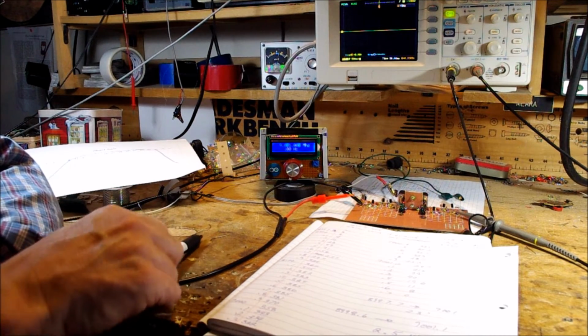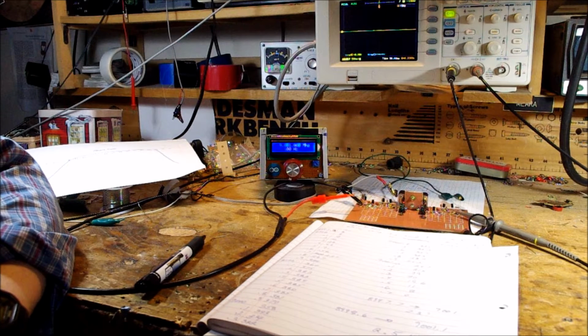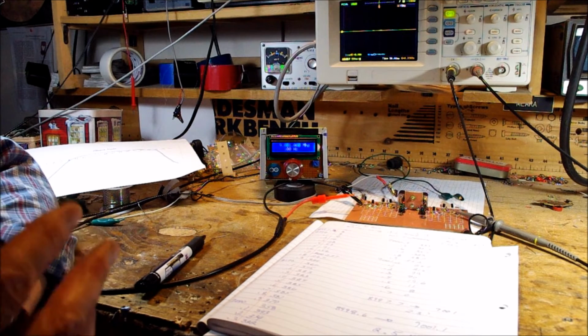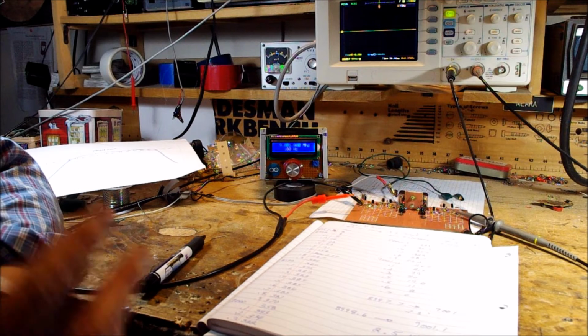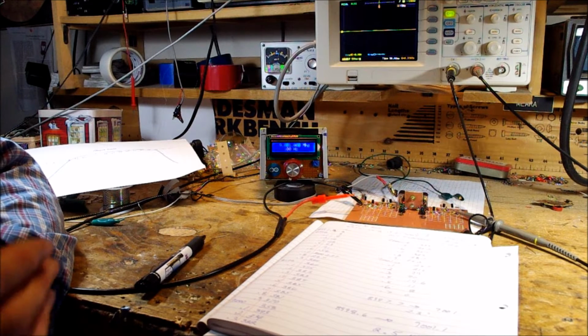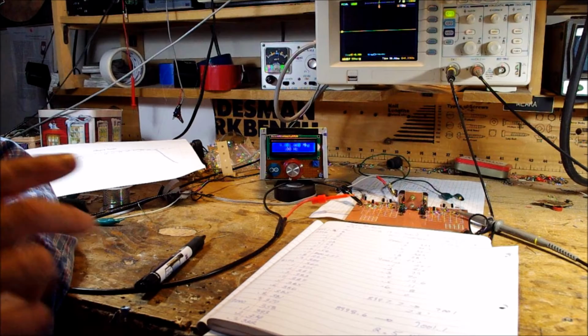The TIA amplifier, the Termination Insensitive Amplifier, was designed by Wes Hayward and Bob Kopchi back in 2009. It is in response to a need generated by the advent of the BITX series of transceivers. The problem is that you need amplifiers that always present the same impedance load to the crystal filter no matter which way the filter is working, forward or backwards, receive or transmit. In a lot of amplifier designs, the input impedance will be affected by whatever's hanging off the other end. They are not termination insensitive. They're termination sensitive or transparent. This design, however, always presents a 50 ohm load at both ends of the amplifier, which is really very cool and very useful.